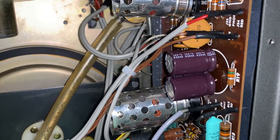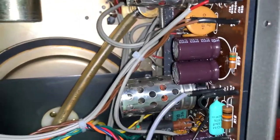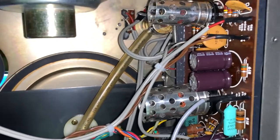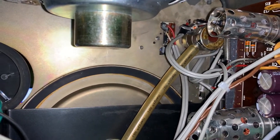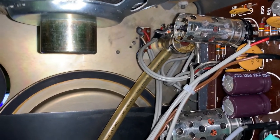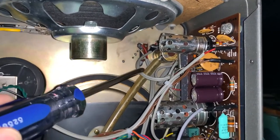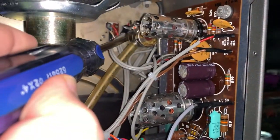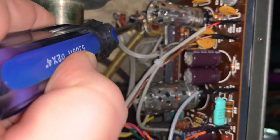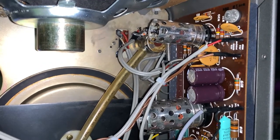Especially when you turn the volume up, it made everything sound terrible. I spent a good amount of time on and off trying to locate this. While I had the front cover out, I took all the resistance measurements to make sure everything was okay. Then something stupid happened — this cable right here is for the tone control, plugs in right there on the board where it says 'tone.' Out of frustration, I took the nut off, pulled the volume, tone, and power switch out, and it worked.